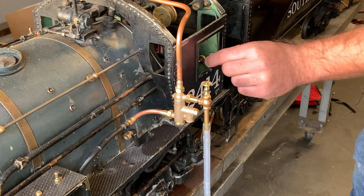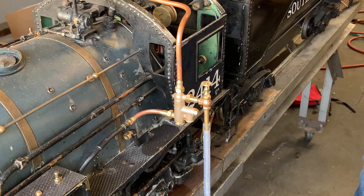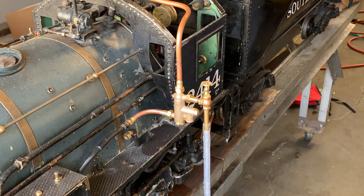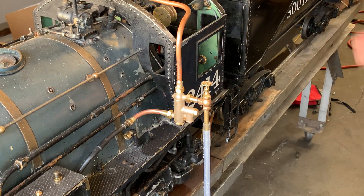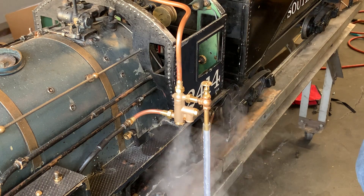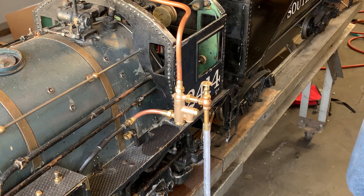This injector is a little too big for this engine, so I've got to let it heat back up. I dropped down to 90 pounds — still isn't bad. This injector I think will be perfectly suited for a lot of medium-sized engines: 0-4-0s, a lot of the Allen engines, moguls, probably even 10-wheelers — it would be perfectly sized. The standard injector, comparable to a super scale or oil cap injector, will work fine on those but they do cool the boiler down pretty quickly.